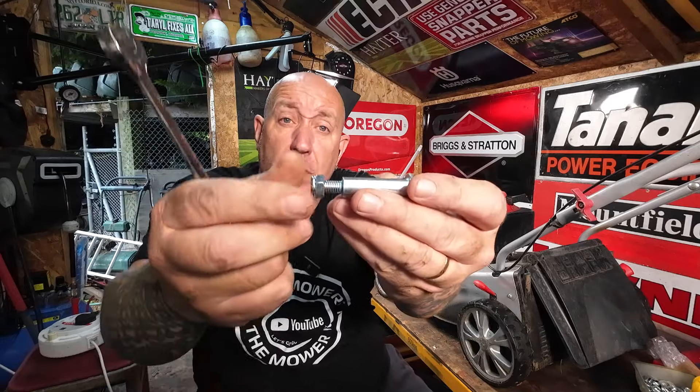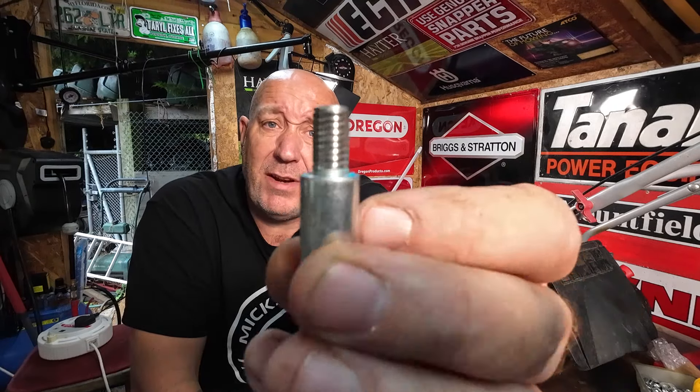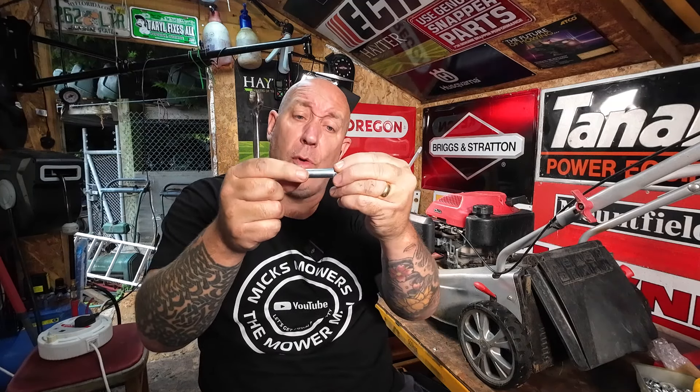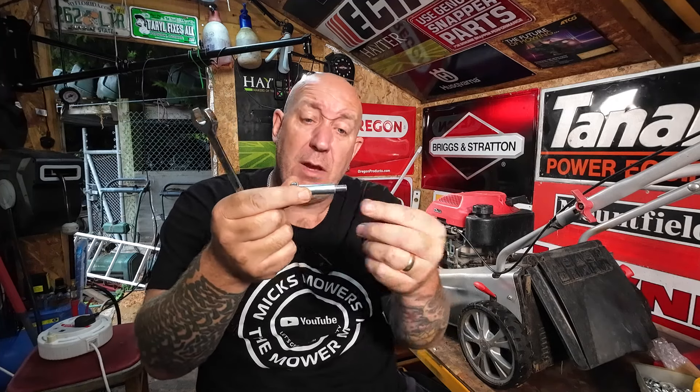This works for any of the machines that have this shoulder bolt setup. What happens is the metal is so tough compared to the bolt, it just takes the threads off — no good for nothing. You can drill and tap them, that's okay, but there's not a lot of support — just that little bit of thread holding it. You've got this massive collar which holds the wheel, but there's not a lot this end holding it. By putting a little tiny M8 nut on the end, that'll secure it and it won't go anywhere. Hope you found this little video helpful.